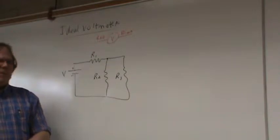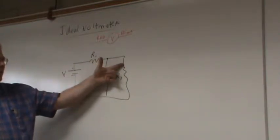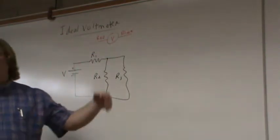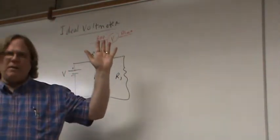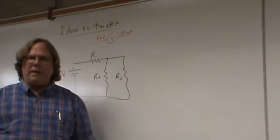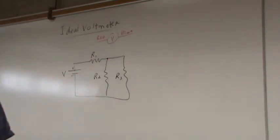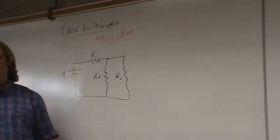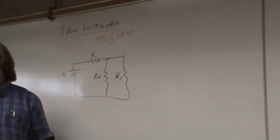Let's have a vote. How many people say I should hook it up in series with R3? Okay. How many people say I should hook it up in parallel with R3? All right. Earl, why did you say parallel? Well, parallel circuits will have the same volt drops. Thank you. Can I just stop you there? I'm going to repeat what he said. Parallel circuits have the same voltage drop.